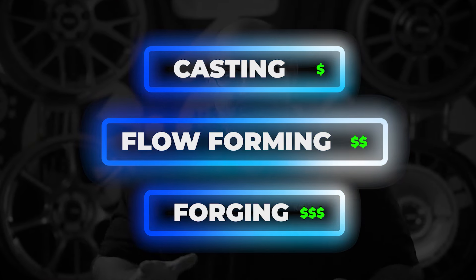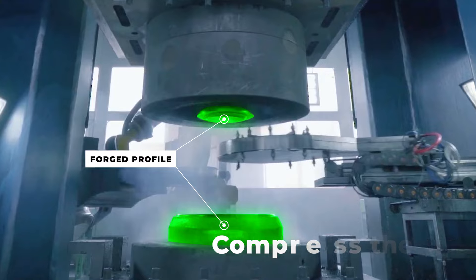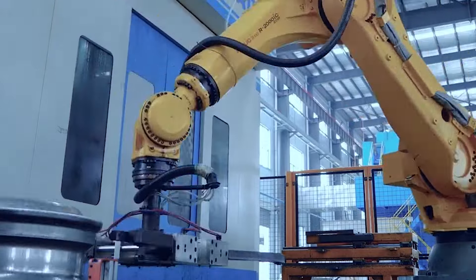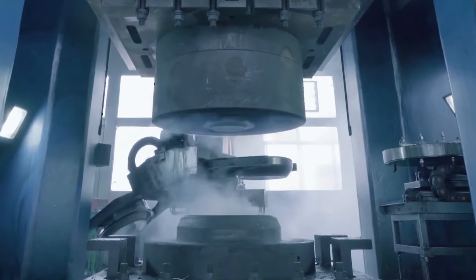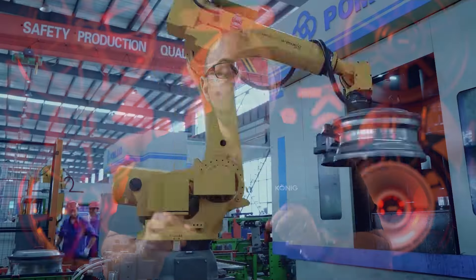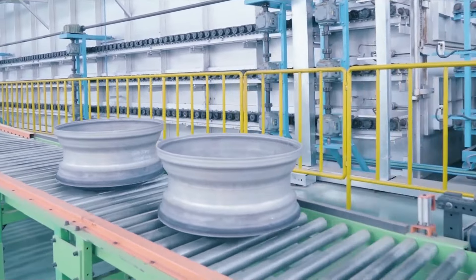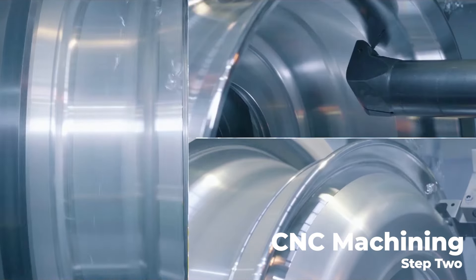Number one, we have to compress that material. There's a mold that sits on top of a press — we use a 10,000-ton press — and essentially under heat we're going to take that raw aluminum billet and press it onto the shape of this mold. Like a die, we're left with a wheel that's about an inch thick all the way through, shaped into a barrel profile. We then take this raw profile onto a CNC, where a program is specified based on the fitment and application we're trying to develop.